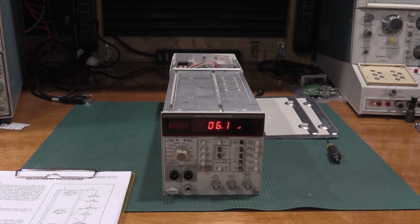But having the 3-bay, I think, would be really good for the low distortion oscillators that I have, the 505s and the 502s. Having them not in a switching supply, even though the switching supplies are very filtered, I tend to get a little bit better performance out of them in a linear supply frame versus a switching frame, but I'm also splitting hairs at that point because we are most definitely down in the noise.